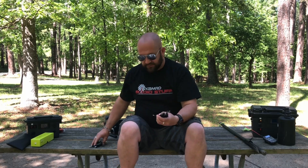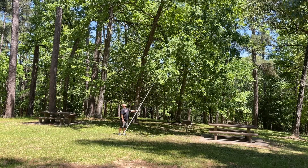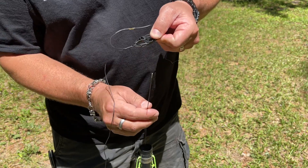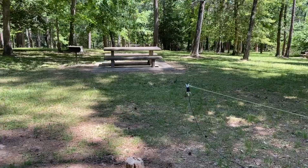The great thing about this antenna is it's so incredibly versatile. It's resonant on four different bands and you simply connect these little banana plugs together to link the two. You can run this as a sloper — I typically put one part of the antenna in a tree and slope the other part into a mast leaned against a tree. You can also run it as an inverted V: take a rope, put it through this hole here, hang it on this metal horn, raise the center carabiner on a mast, and stake off the other end into the ground.